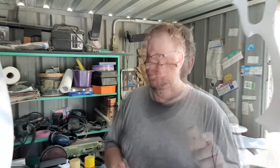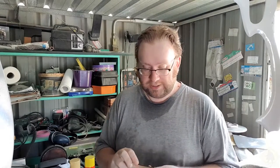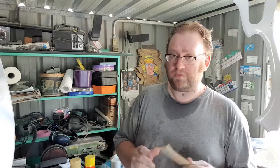And also, always move in the direction counter to the blade spin, I believe. So in this kind of table setup, it's left to right. The blade spins, and you're basically feeding it across the blade as it's cutting. Always do two or three passes. Two is a bare minimum. First pass is just going to be your rough cut, so it's just going to get rid of most of that excess material. Your second pass is basically just going to clean that up. Your third or fourth pass is fairly redundant, but if you just want to be paranoid, make sure you've got something nice and smooth, just do another pass. But definitely do more than one. Just don't think your first pass is literally going to cut it. See what I did there.